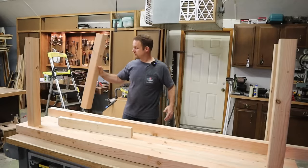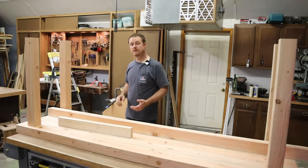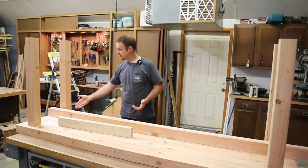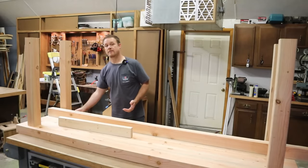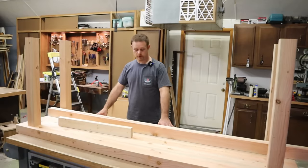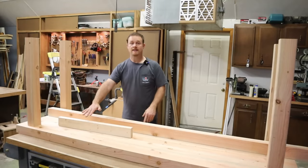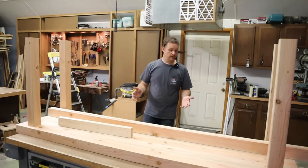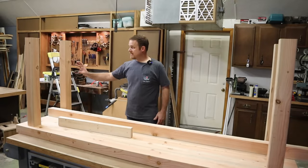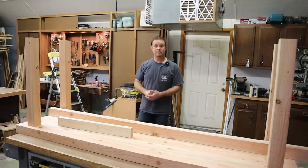I've been playing around with different spacing of the legs. You've got a lot of things to take into consideration — the narrower you make your stance, the less stable your bench is going to be, but the wider you make your stance, the less room you're going to have for clamping on the edge. To combat that, I'm not planning on putting a front stretcher at the top, just at the middle for the shelf. At the back, I'll have one at the top and at the bottom. I think I've got my leg spacing figured out. The next step is to put dados in the legs to accept the cross members and stretchers, and we're going to do that at the table saw. I'll mark all four legs for the bottom stretcher, but only two of them for the top stretcher.